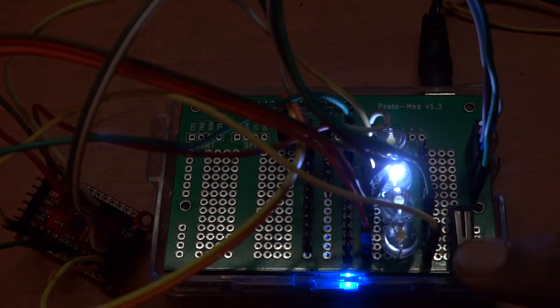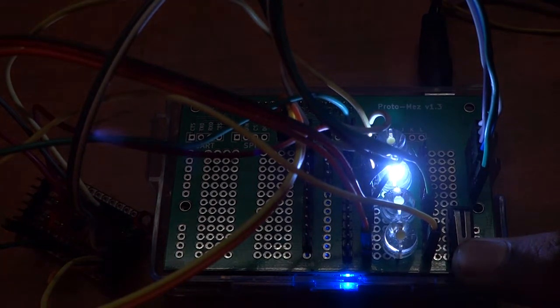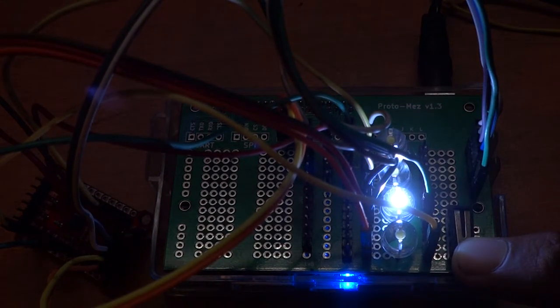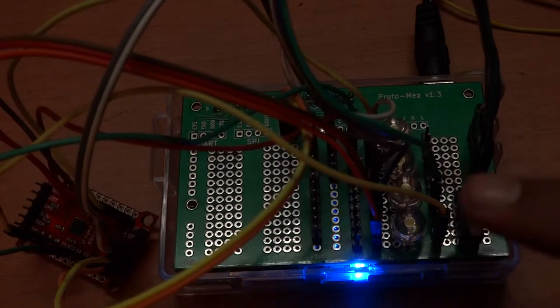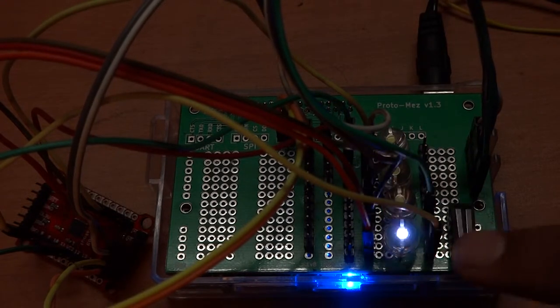It's basically starting the LED from 0% cycle, running it up to 100% PWM cycle. It is 8-bit PWM, so it actually goes from 0 to 255. And if I change the switch, or if I tap the switch quickly, it would just move on to the next LED.